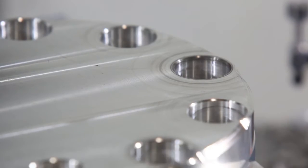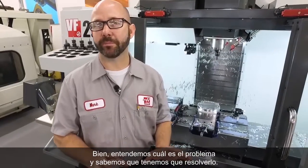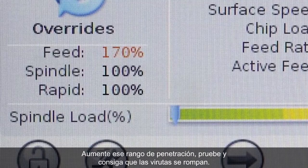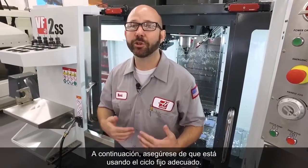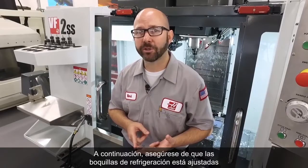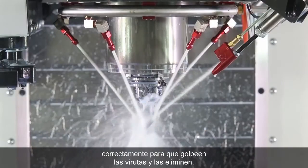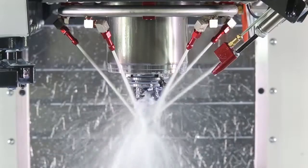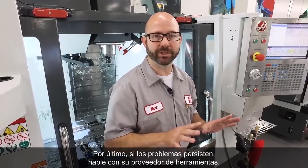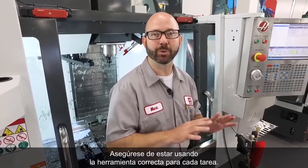This isn't good either. We understand what the problem is, and we know we've gotta fix it. I would usually start with my feed rate — increase that feed rate, try and get those chips to break. Next, make sure that you're using the right canned cycle. Use a G73 or a G83 canned cycle to peck drill and try and break those chips that way. Next, make sure that your coolant nozzles are adjusted just right to knock those chips off and out of the way. Finally, if you're still having problems, talk to your tooling supplier and make sure that you're using the right tool for the job.